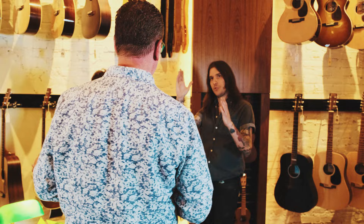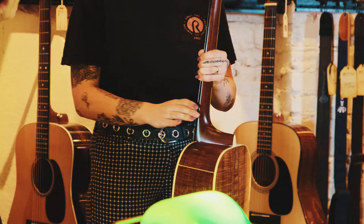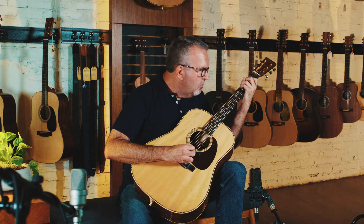Is it proportionate — like dragging the corner of a Dreadnought shape? We're slightly under half an inch wider at the top and about six tenths of an inch wider at the lower bout. So proportionally it's very similar. The proportions and exterior perimeter don't deviate from our regular Martin Dreadnought design — they're just larger. We blew it up a little bit. We kept the Dreadnought proportions that our enthusiasts love and just grew them outwardly, so there are no funny angles to contend with. It's a Dreadnought, just larger.